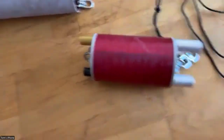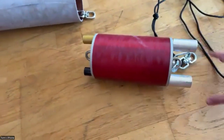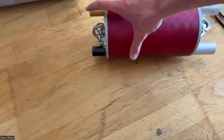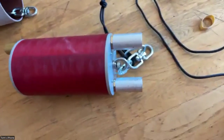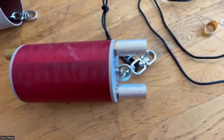So what we've got here is the avionics bay. It's just a COTS coupler from Wildman, and you can see the standard smaller charge wells for the main deployment. But because the drogue's a high altitude deployment, we've got a slightly different set of deployment charges here that our recovery lead will quickly talk you through.